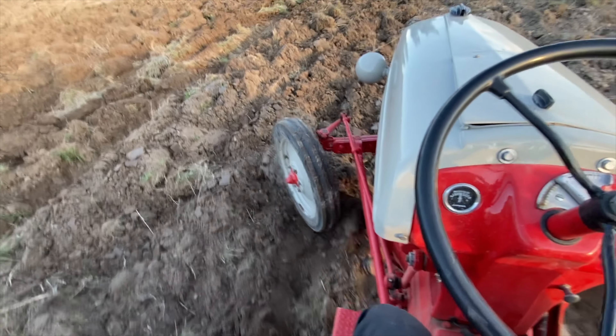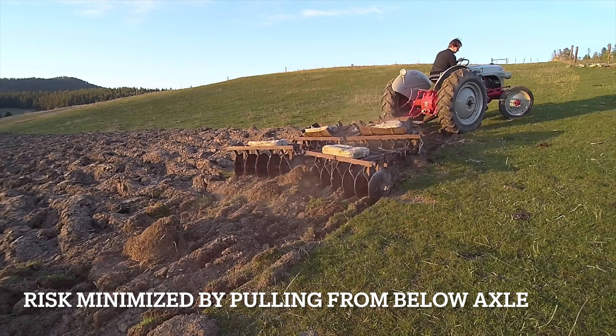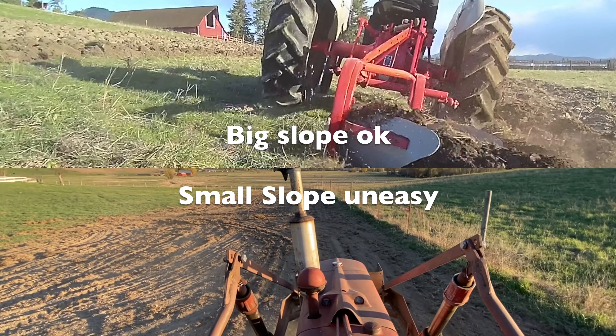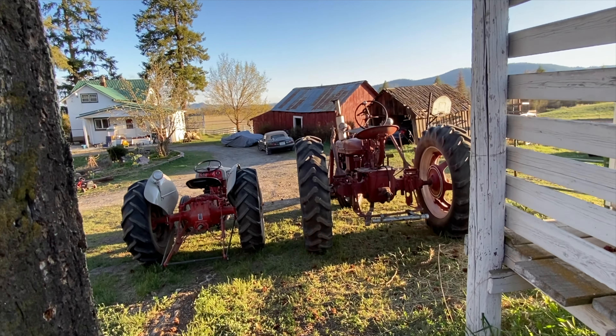Surprisingly, although it technically has a little bit less power, I find that the Farmall is pulling these implements a lot better than the Ford. It seems to have a lot more traction, a lot more weight, a lot more steering authority, and gets a little less unsettled by the small bumps. But I also like to live, and I get a very uneasy feeling on the Farmall on any sort of a hillside compared to the Ford. Interestingly, I think the Ford might actually be a little bit tippier for going over backwards, which is one of the real big risks. It's really just a feeling of unease — any minor ground angle is exaggerated many more times by the height I am off the ground.